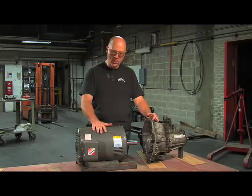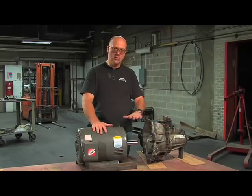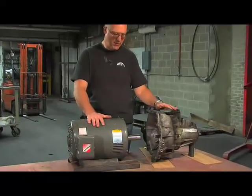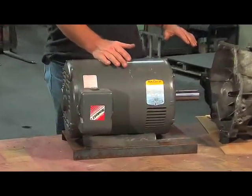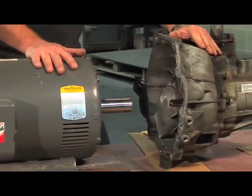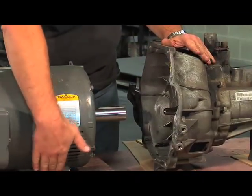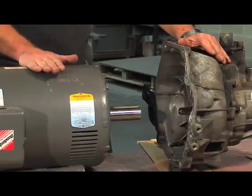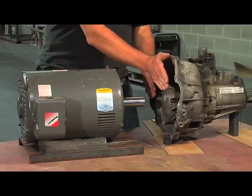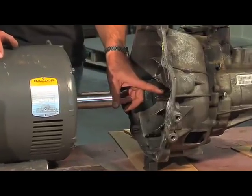What I've got in front of me is the motor I'm going to be using in my car and the transmission I'm also going to be using. It's a lot easier to do this with the two out of the car because you can handle alignment, get your holes drilled, get everything working. There are two things you're going to have to connect. One is the physical pieces — you're going to have to somehow bolt the motor to the transmission. Because the motor is mounted on the bottom, this is going to be an L-shaped motor mount. A lot of cars use a motor that mounts off the face and you'll wind up with just a plate between the two. The other part of the connection transfers power from the motor into the transmission.